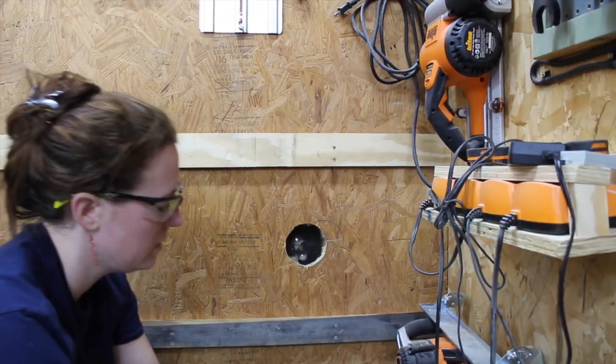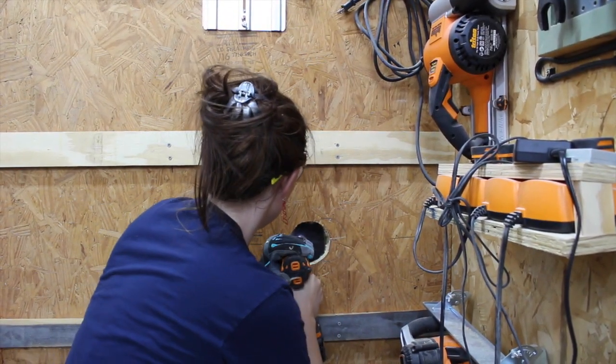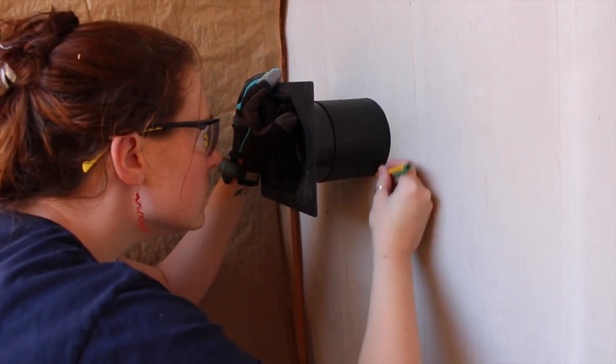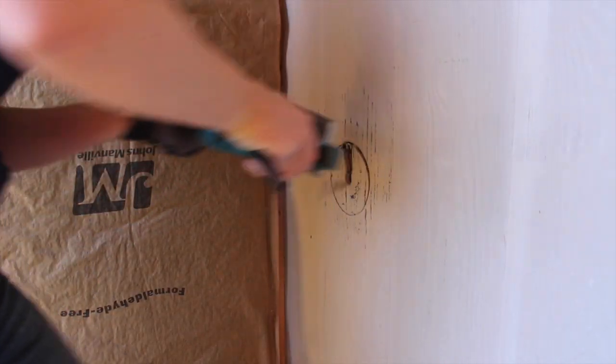However, to better locate this hole, I drilled 4 additional holes at different points around the circle, making sure that my bit was pressed up against the edge, so that whenever I moved to the outside, I could use the fitting and place those 4 holes inside the diameter and then just trace around it. This gave me my circle to cut out with the jigsaw.